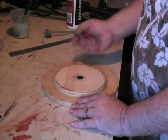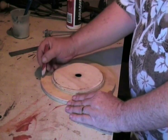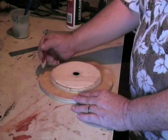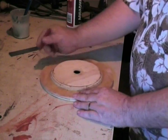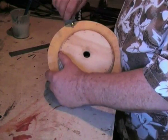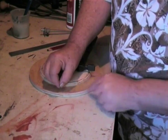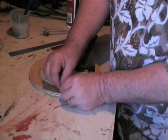The next step is to just make a mark on the outside of the rim, approximately in between the locations of your last nail. With a marking gauge set at 10mm, just mark off, and then with the nail, the angle is to be parallel to the outside circumference.